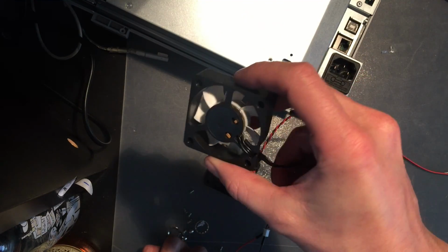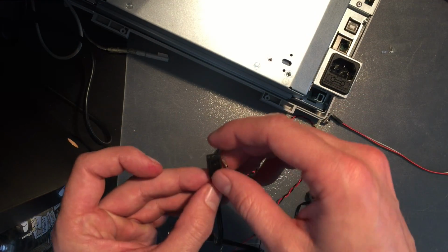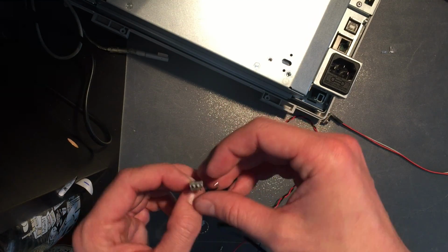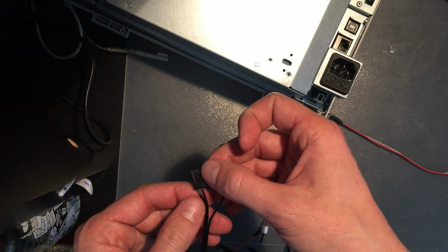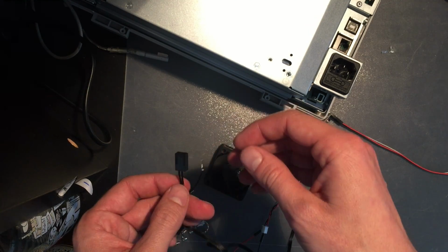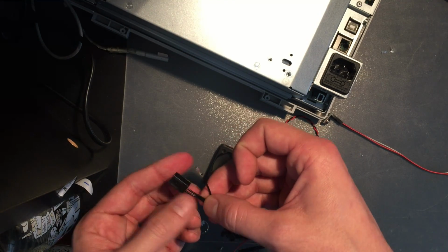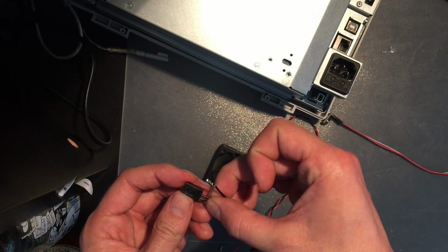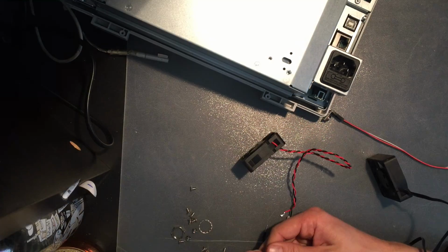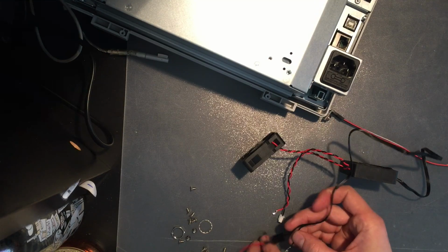I don't know about the pin out for this one, because it's a 3-pin one. So one of the pins is obviously for either PWM or a sensor for measuring the speed of the fan. I guess pushing in 12 volts in the sensor is going to break it, if that is what the last one is. If it's a PWM, it hopefully just treats it as an always on signal. Yeah, I'm gonna look some on the internet to see what the deal is with this specific model. Positive in the middle, and then come on.